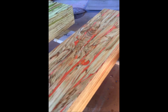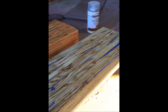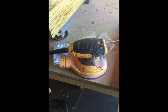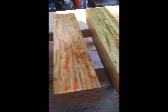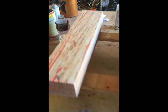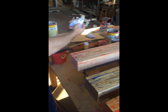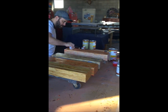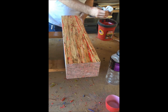That's actually an orange and it's very, very orange in person. And there's the blue — the blue really pops. So here we are: we did our final sand, very quickly and lightly used the sander with 320 grit sandpaper and went over each one. We've already done final coats on these three and we're getting ready to do the final coat on this one. On the final coat you want to put on a fairly thick coat — you'll notice it glides nice and smooth because it's already been sanded, and you no longer have to worry about bleeding because it's already been sealed with your first coat.